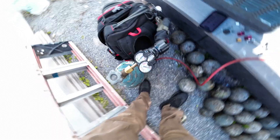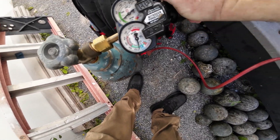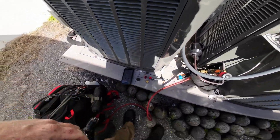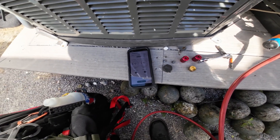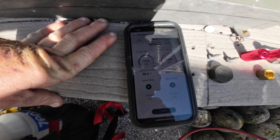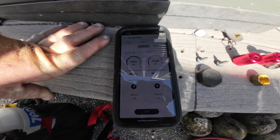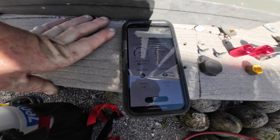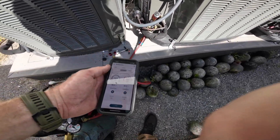It's bad karma to put your torches up before you're done. So cranking it up, we're doing a pressure test and then we'll put a vacuum on it and put the inside together. I want to let it settle and then we'll go from there. She's holding. We've been doing it for a while now.